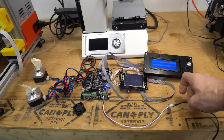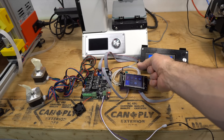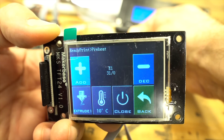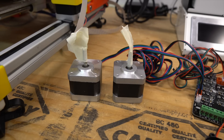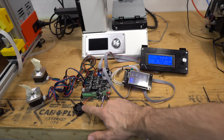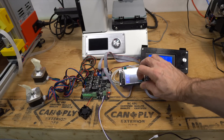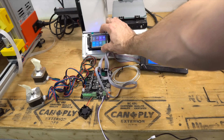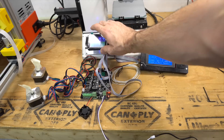So it's kind of working right now. I've added that screen just to have a look at what's happening in the Marlin firmware. I have a temperature probe so I can see the level and do some small moves with the motors — say 10 millimeters Y and X. Everything is working; I have a basic Marlin install inside here. That fan will come on at 50 degrees, almost like the original, and the screen will be easier to navigate than the push button underneath the bed. I flipped the screen so the SD card is on the left, making it easier to push in and take out without the bed in the way.